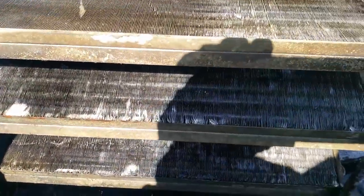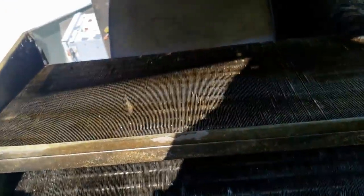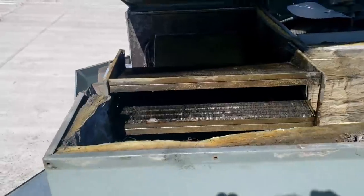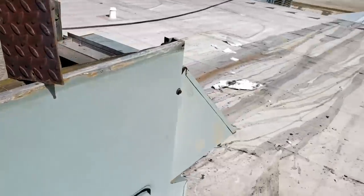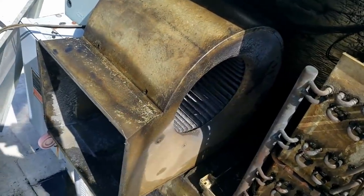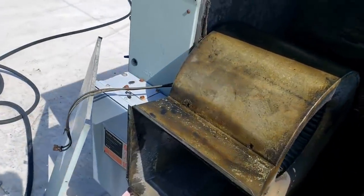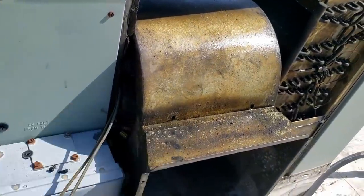Making multiple trips back an hour away is a lot of wasted time, so it's quicker in the long run to just sit here and work at it. I'm washing the blower — I've washed with motors in there for years. I don't recommend using any cleaner in there. Work your way slowly from the bottom down and don't let it spin, because if you do it'll get into the motor.